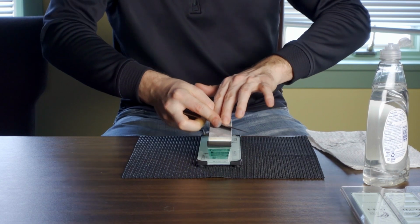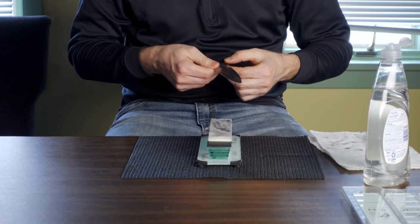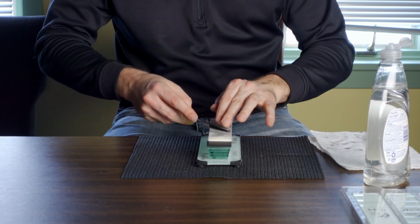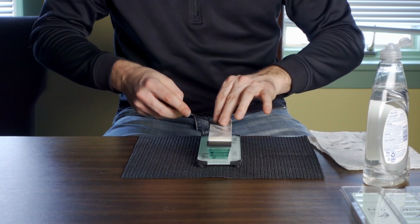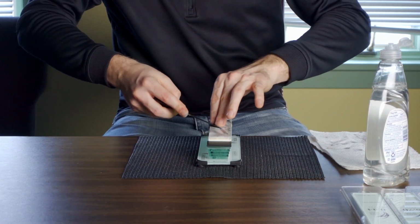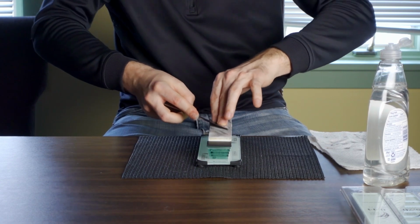Yeah, one great thing about these stones is the slurry. It is just such a wonderful feel to it. It stays on there very well. There's just so much good to be said about these stones. All right, so one thing you'll find when you're sharpening is if you've formed a burr on one side of the knife already, the other side forms it usually a lot faster because you're just flopping it besides moving some steel. So one thing I do want to make sure is that I still sharpen the side enough even though the burr has flopped over.